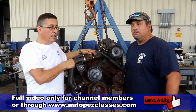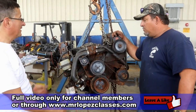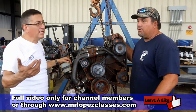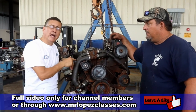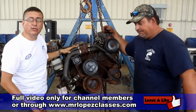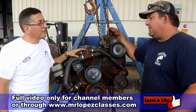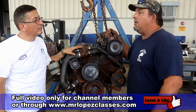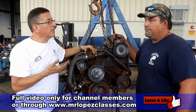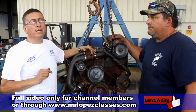Raw water in an inboard is catastrophic — absolutely. Look at that corrosion. There's no protection for the engine; all the passages are getting raw salt water, so everything is susceptible. Additionally, the block and heads are iron, and iron in contact with salt water produces that result. Why do they continue producing those systems? It's cheaper. It's roughly a $1,500 to $2,000 upgrade to convert, and yes, you can convert — you need to add a heat exchanger and change or block off the risers.